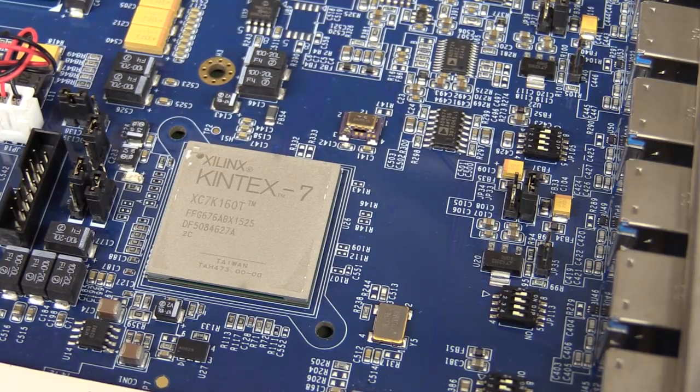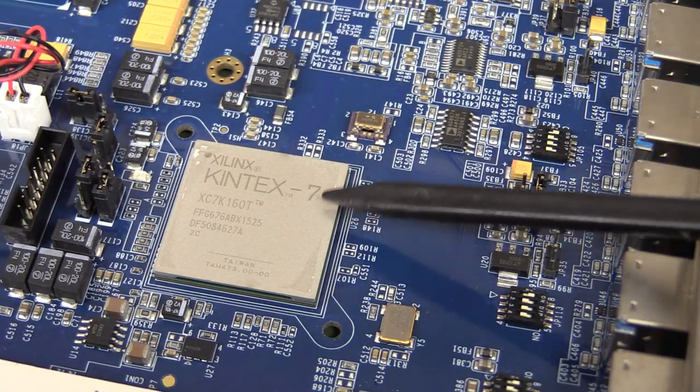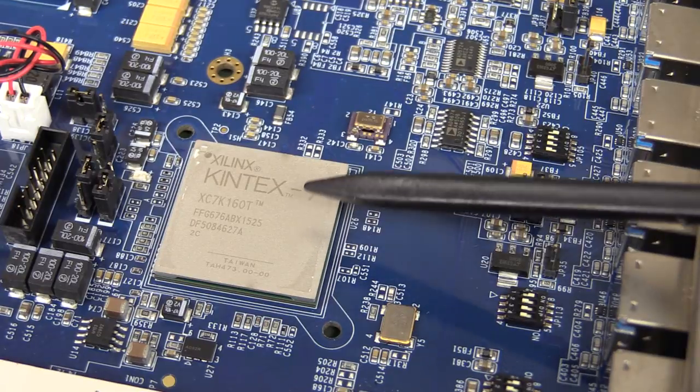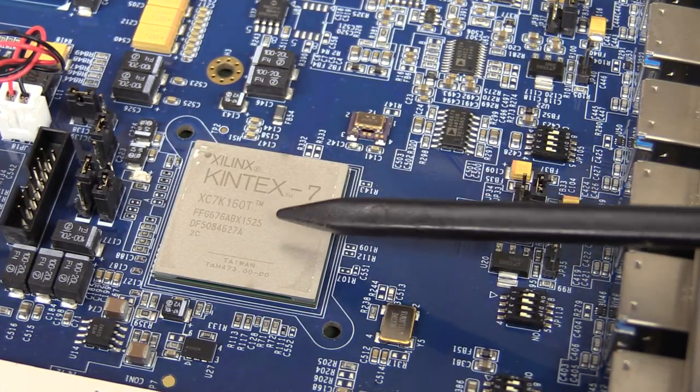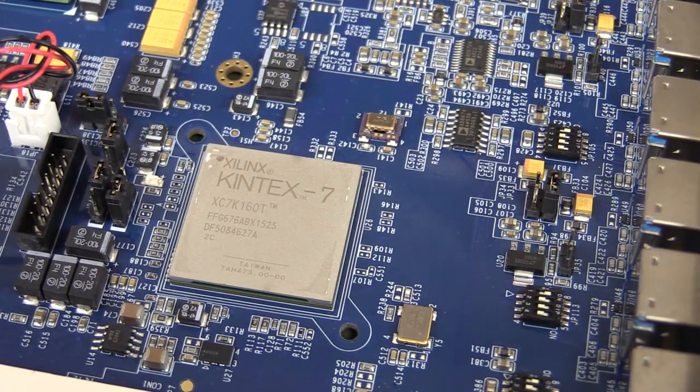You wouldn't be rolling your own ASIC for something like this unless you were looking at really high volume. And something like this, a 3 or 6,000 logic analyzer, you're not going to be selling them in the hundreds of thousands. You're going to be selling them in the hundreds, thousands if you're lucky. So what they're going to be implementing in there, of course, is serial straight in. So the 32 or 64 channel serial differential pair straight into the SerDes, and then into the logic array, where they're going to be implementing hard serial decoder functions and hard serial triggers, because you can trigger off a whole slew of different protocols. So that'll all be programmed in there.